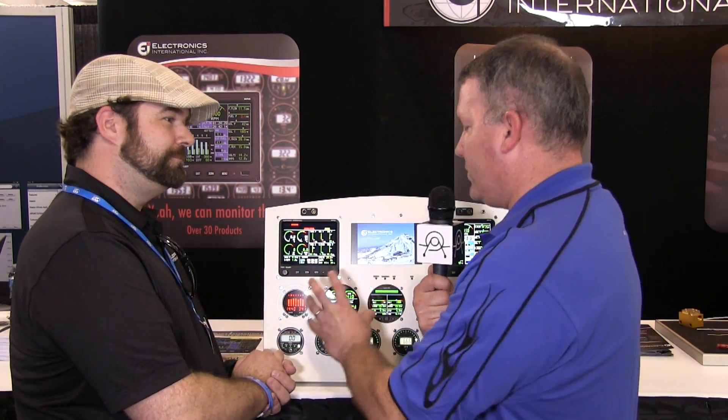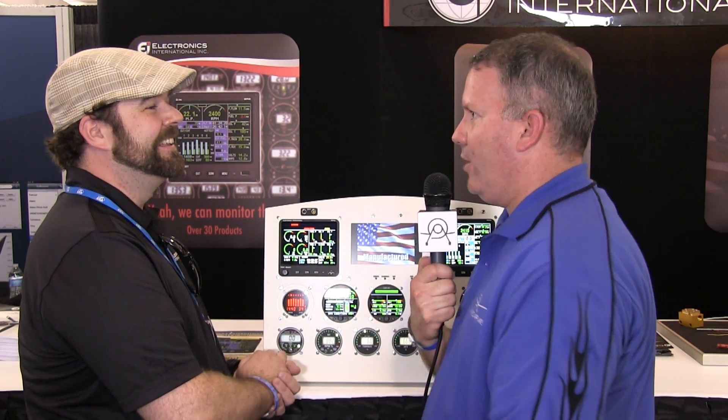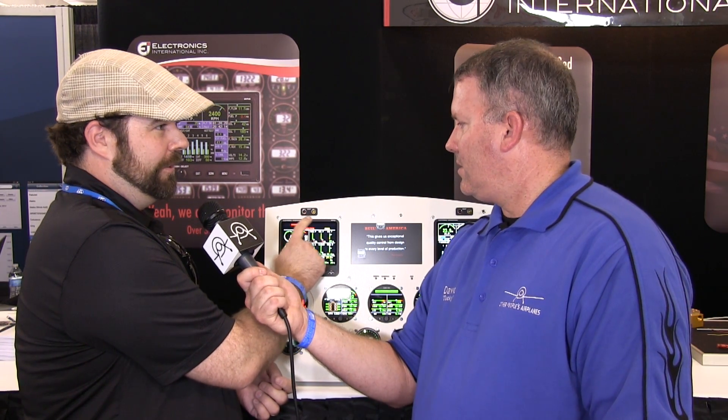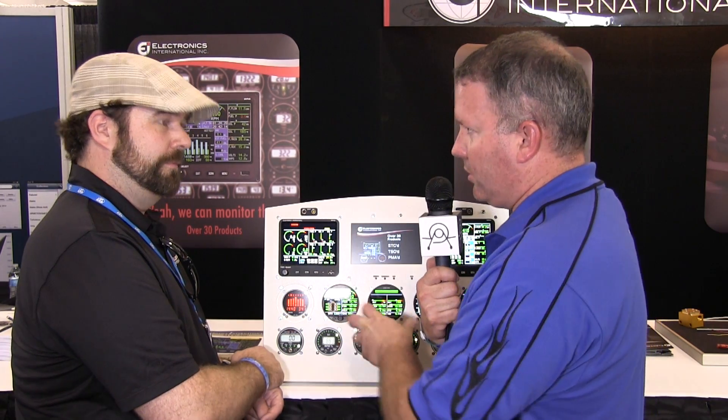So much great information in this one spot. The only danger I'd see is getting fixated on it and flying the airplane into the ground because there's just so much great information there. Well, to speak to that point — it is quite a bit of information, but what comes with this is two alarms: red and yellow. So you can do your normal scan, and if something goes wrong with any of your engine parameters, this instrument has a master caution light. If you put these in your scan, just those two lights will bring your attention to the instrument when you need to look at it, not just because it's eye candy.